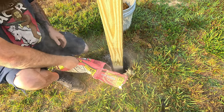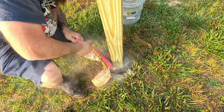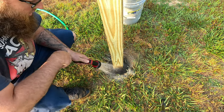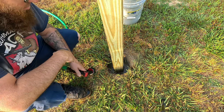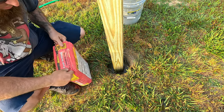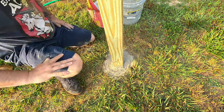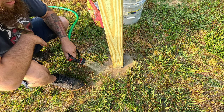It's a 50-pound bag — I'm only gonna put two in there. That's 100 pounds of concrete on it. I'll get the hose now and add a little water in between, just get it on a little shower. That's what this stuff is made for — it works its way down through there. This will set up pretty quick. I only need about a quarter to half of another bag. You don't have to use this red bag — I think it's a dollar more but it really cuts down on the time. It's hard to beat some ready mix concrete. It also pulls the moisture out of the ground to help set it up.